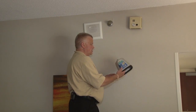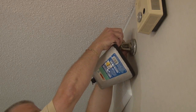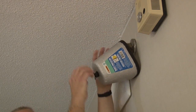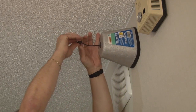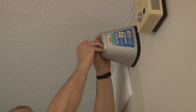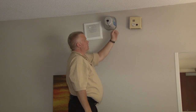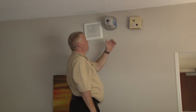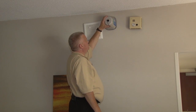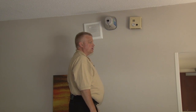What you want to do is take your outside spigot faucet cover — it has a loop — and just put it over the sprinkler head, being gentle because you don't want to set the sprinklers off. Pull the string tight and tighten it down. Once you have that on there, make sure the quick adjustment is tight. Your smoke detectors won't have any problems as long as they're not heat sensitive — check that with your local codes. Once the sprinkler cover is in place and tight, it will hold and you'll never have a problem breaking your sprinkler heads.